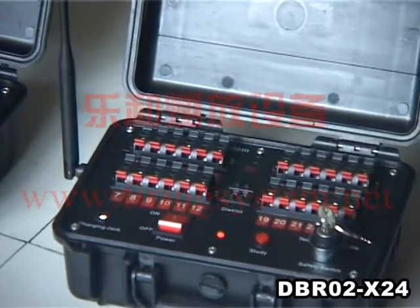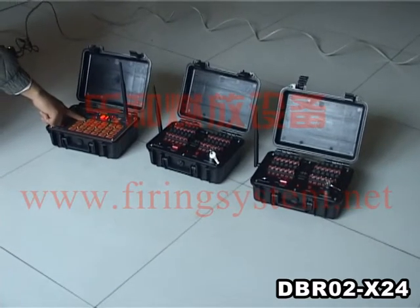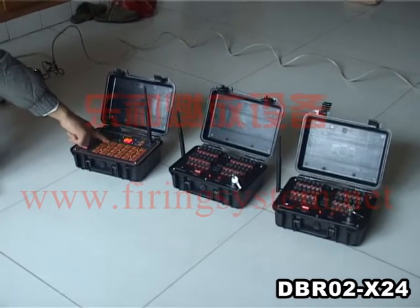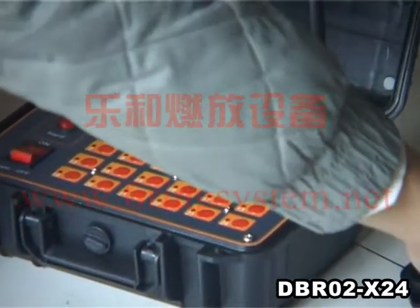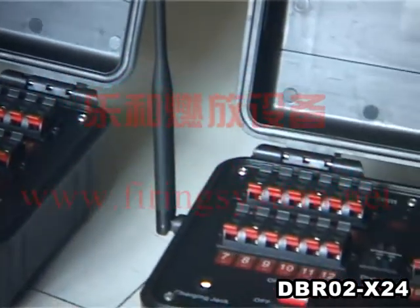Adjusting all to district 0-0. Pressing the first button on the transmitter — the two receivers will flash at the same time, meaning one transmitter can control two receivers simultaneously. Now adjusting to district 0-1 and pressing the transmitter, both receivers receive the signal.